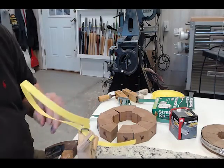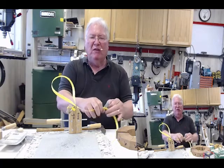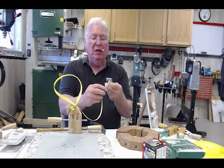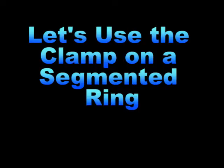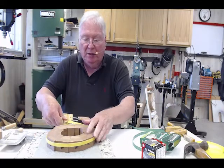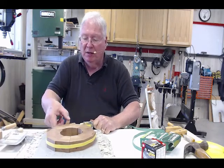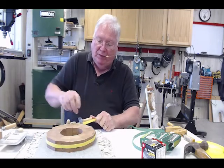On that loop, take a cam lock buckle — you can find those on the internet, buy a pack of 20 for $20. Feed your strap through the bottom of the cam buckle with the lever on top. Take your loop, wrap it around the rings, pull the loop tight finger-tight with your hand, and then move the cam buckle up toward the end and set it. Now with your piece in there and the clamp open, you can easily handle gluing up your pieces.